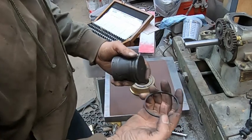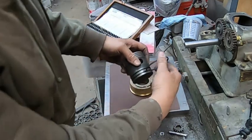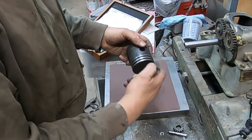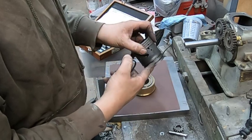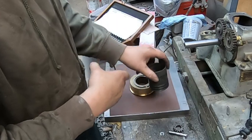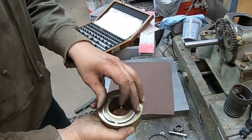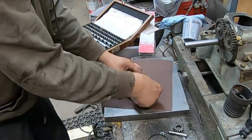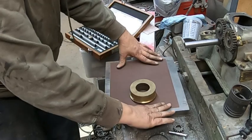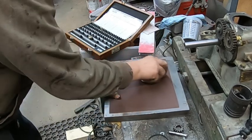Here's one of the new rings and it's fitting tight — there's no way I'm getting a two-thou shim through there. I don't have a piston ring groover, but I've cleaned this up a little bit on the lathe with emery cloth. I had a piece of ground plate — just a little spigot to hold my ring — and put it on the emery cloth. Do figure-eight patterns or just move it around. Then give it a clean.